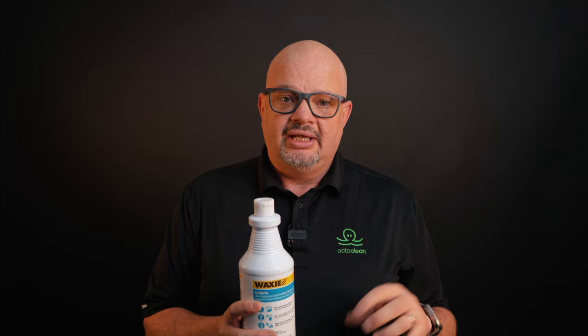We could talk all day about the pH scale, but I recommend you go look it up so you can understand it. If you're dealing with a coffee stain in a stainless steel sink — and you'll see them, they turn gold — you might think, I scrubbed it, I put glass cleaner on it, I put heavy-duty degreaser on it. But once those coffee deposits dry, the only thing that gets that stain out is an acid.